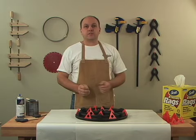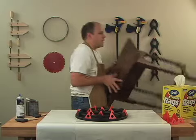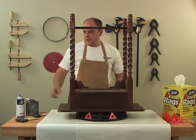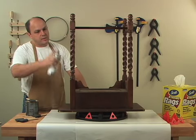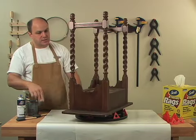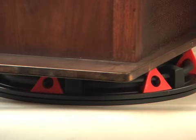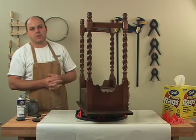All you need to do is set that down on top of your finishing table. Grab your project — in this case, I'm working on refinishing an old antique table here. We can set that down on top, and what this is going to allow us to do is we can spray the surfaces or we can use a brush and paint all those surfaces. And instead of touching the side and getting smear prints or getting finish all over our hand, we can rotate our project around, making it very easy and handy to get our projects finished in a quick fashion.